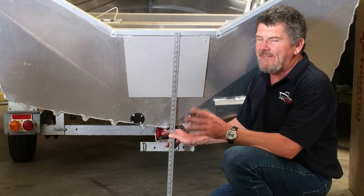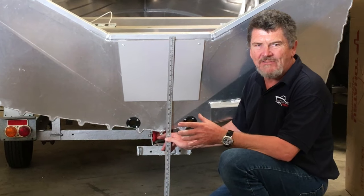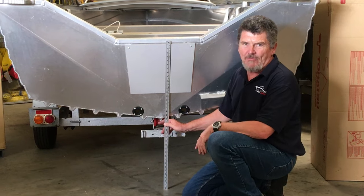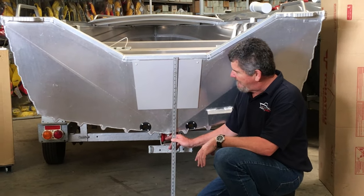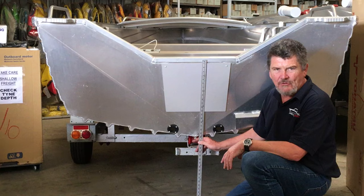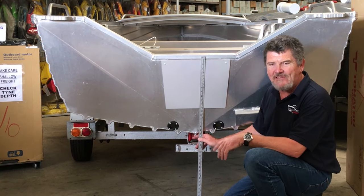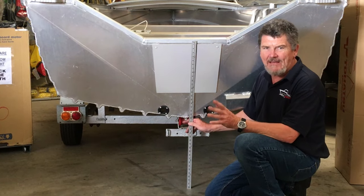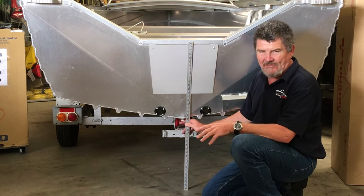Keep in mind there can be a variation of up to 50 millimetres depending on the manufacturer of the outboard and also the builder of the boat. Within 50 millimetres specification is pretty good — unless of course you're a racer, which is a different world we can cover another time — but for the average fisherman, what we've just said is pretty much it.